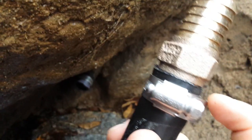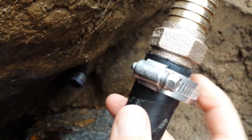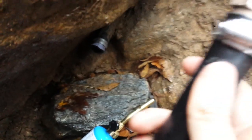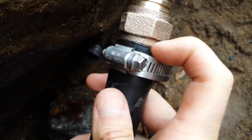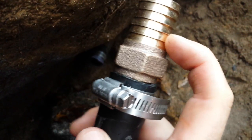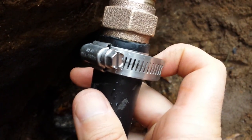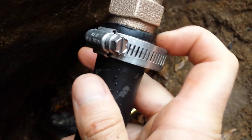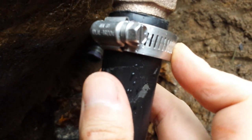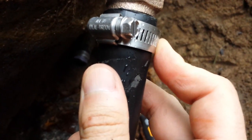What you do is heat the plastic on the inside and outside for a few seconds — not a minute or two, just a few seconds with a propane torch. Heat it inside going in circles, heat the outside going in circles, then stick the barbed fitting in until it butts up all the way. Put it in while it's still hot because it goes in real tight, but when you heat it up it'll slide right in. As soon as it's in, put the clamps on and tighten them down really hard. As it cools off it'll conform to the barbed fitting.